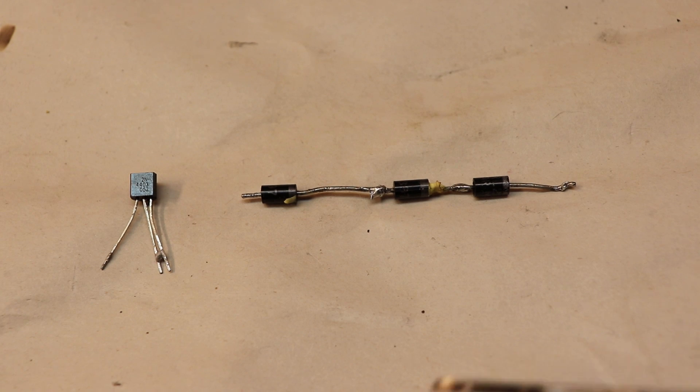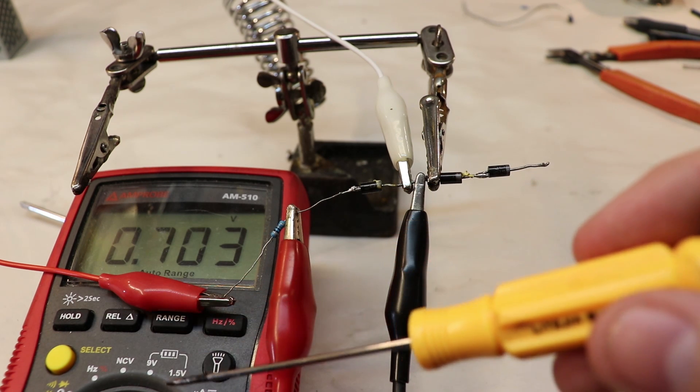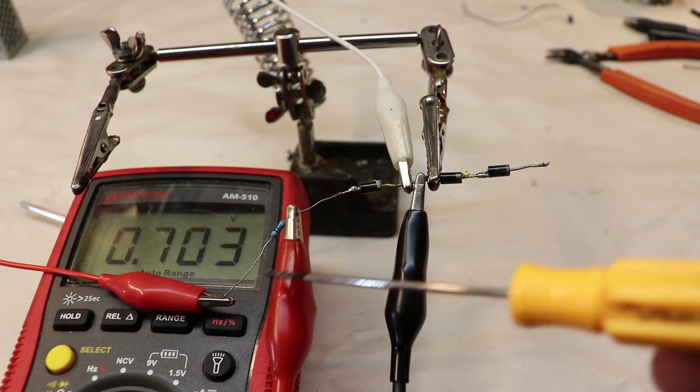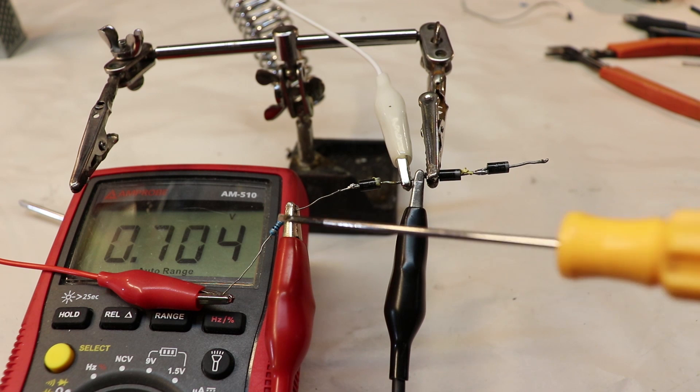If you've ever worked with diodes, you know there's a forward voltage drop and that is around 0.6 to 0.7 volts. That voltage is required across the diode in order for it to start working, start conducting. Here you can see exactly what I'm talking about — this is the forward voltage drop of the diode. Where the red alligator clip is, I have my positive side of my power supply connected, running at like 5 or 7 volts. The white alligator clip is ground, and the bigger alligator clips right across the diode are my multimeter measuring the forward voltage drop. The resistor over here is just to prevent the power supply from shorting itself out — this can be a 1k ohm resistor but you can really use any resistor that works.